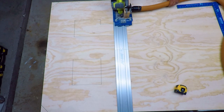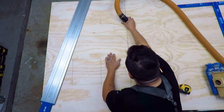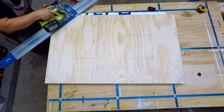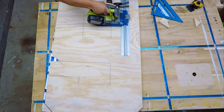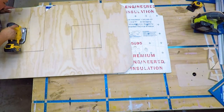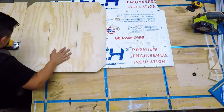There are various ways that you can do this process. I know some people use a jigsaw. I prefer to use my skill saw on all of the cuts that I can. I'll come in and finish off a couple of the smaller areas with a jigsaw, but I find this gives me straighter cuts, so when I'm attaching my frame I have minimal gaps that need any sort of filling, which we will get to later. And here I am with my jigsaw, just cutting those little corners that obviously the skill saw cannot cut out all the way.